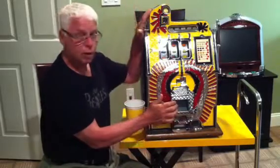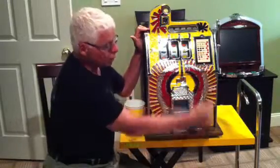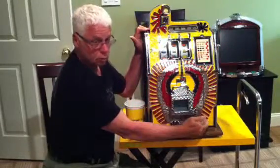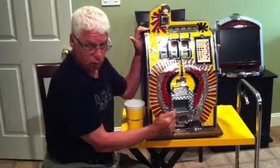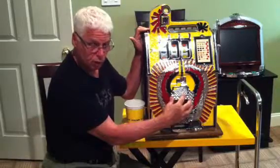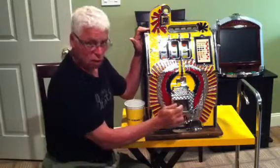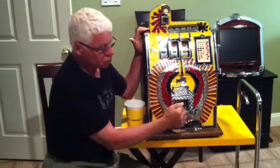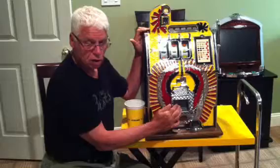When you first get the machine there's a big payout tube in here that holds about 300 quarters, and that's what makes all your small payouts. As you play, the quarters fill up the payout tube — about 300 quarters. Once that's filled up, the quarters start being diverted to the jackpot window. This holds about $25 worth of quarters. Once the jackpot window fills up, the quarters go into a coin box in the back. So this won't start collecting quarters for quite a while after you first start playing. When you get bar bar bar, this jackpot window dumps out and $25 or so worth of quarters come out, then the whole process starts all over again.